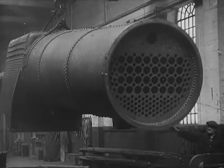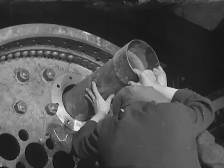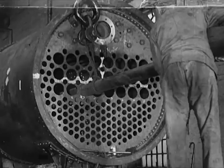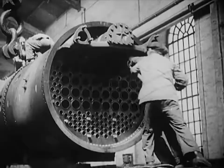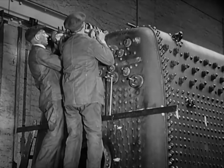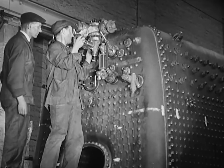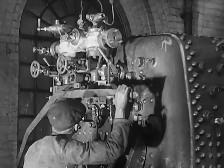This is where the mysteries go in. A modern engine has a big appetite for steam, hence her large grate area — 45 square feet — and her high amount of tubing. First to go in is the main steam pipe, through the centre of which will later go the rod connecting the regulator handle to the valve. Now the smoke tubes — there are 112 of these, each 19 feet 6 inches long. The 32 superheater tubes which are screwed to the firebox tube plate are the same length. If you care to work it out, number 6207 carries more than 2,700 feet of tubing. Meanwhile things have been happening at the other end of the boiler, and some familiar objects have been finding their way onto the fire door plate — this is a regulator handle.